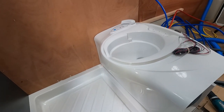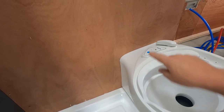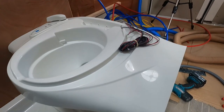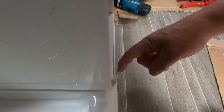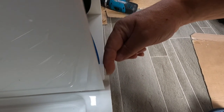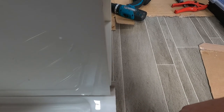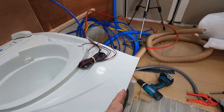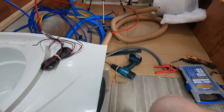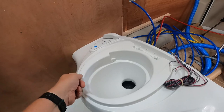The toilet is offered into place - not fixed yet - and as you can see it covers the hole around there nicely, so that's a nice silicone splodge area. What I was hoping for - and this is purely by coincidence but it's worked out brilliantly - is that on this corner the shower tray just overlaps by about four or five millimeters from the toilet, which is very slightly recessed. That is absolutely perfect because it allows me to put a 2mm sheet of UPVC panelling on each side, and the toilet is going to sit absolutely plumb perfect right in the middle of the two without big gaping gaps to fill.